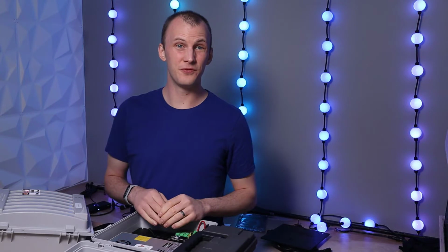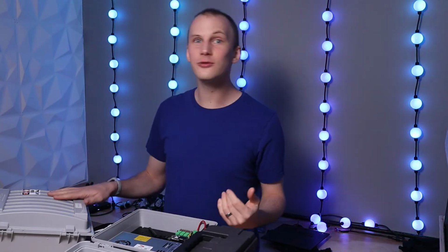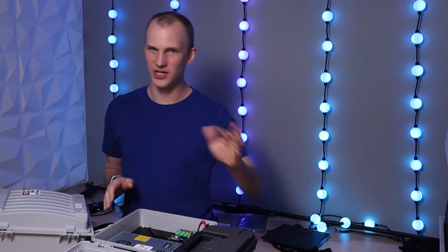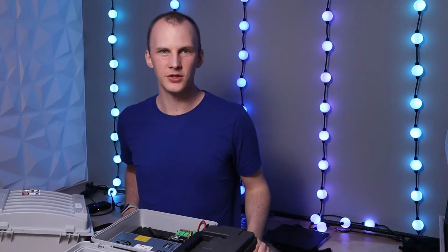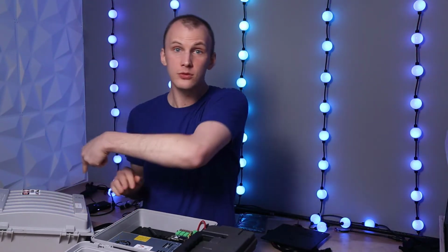It comes from my time in the stage lighting industry, which, I mean, I'm still in that industry. If you number controllers, that just gets confusing, because now you've got controller 1, and then you've got all your outputs on that controller, which are also numbers, right? If you use a letter for your controller, now you can do 26 controllers. And when you finish that up, you can go AA, BB, etc. You just keep going. So I like to letter every controller, name it in xLights, and also on the controller itself, with that letter code, and then you'll be good to go.